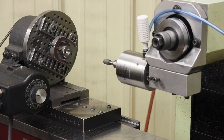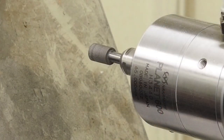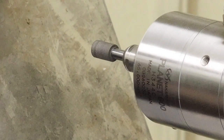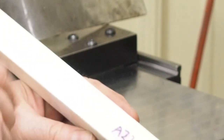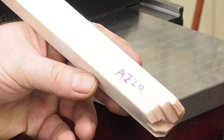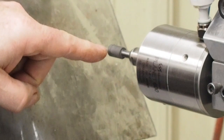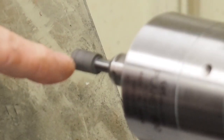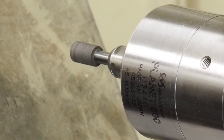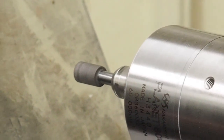The finish looks pretty much like what we saw in the still picture there. What I'm going to do now is grab a white stick and clean this wheel out. What we have here are aluminum oxide cleaning sticks — these are 220 grit, they're very soft — and what I'm going to do is clean some of that buildup out of here and expose a little bit more of the CBN, taking some of the rough spots out.